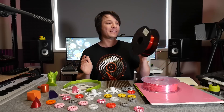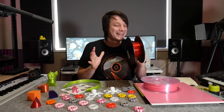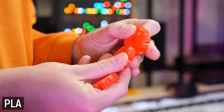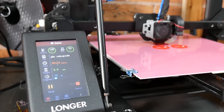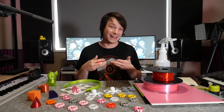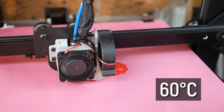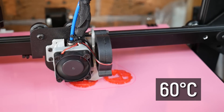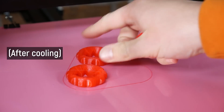I did a few different types of PLAs, starting with a bulk standard red translucent PLA from around 2016. The thing about G10 is it has to be heated for the prints to stick down. You can cover it with glue stick and print unheated with PLA if you really had to, but 60 degrees C works super well. The first layer stuck down amazingly - you could touch the brim and really feel how well it was stuck - and after the print the bed cools down and the parts self-release.